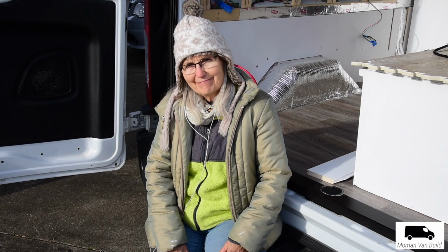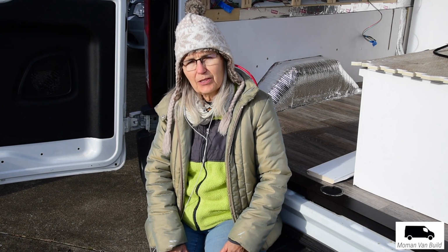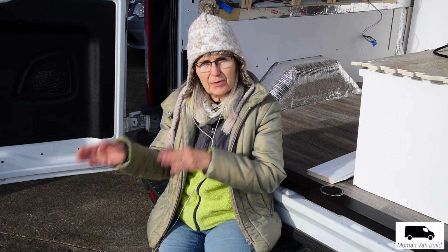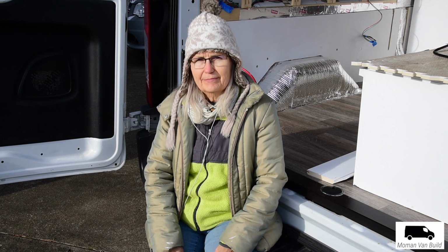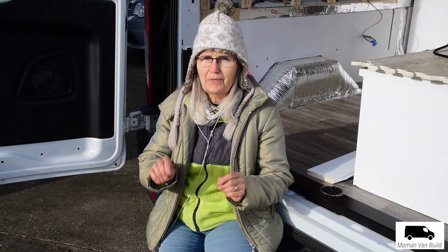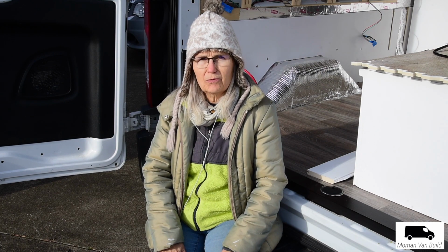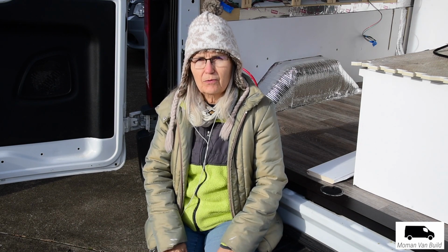Woohoo! We showed two things that happened, right? Right. And they were? I had to redo the window frames, both of them. Actually, I made 6 window frames for 2 windows because I originally made 2 and then redid them and then redid those. Are you going to be happy with them now? Yes. And then the bed frame? Well, I still have one more window frame to do. And with the bed frame, the pocket holes kept splitting the wood. I don't know if the wood was old or something, but I'm doing it more carefully and overlapping the wood just a tiny bit, so I won't do that.